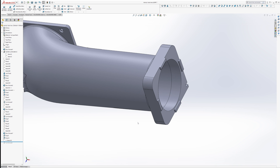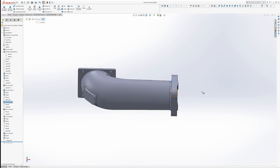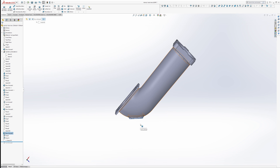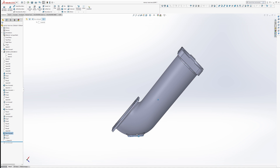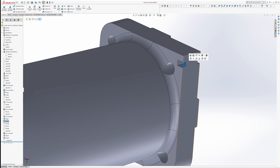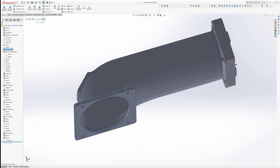There are a lot of dust collection flanges on Printables or Thingiverse, but I decided to design my own since I was already designing this part. It just has a couple of nubs that mate to the opposing part, and there are some pockets for magnets so it'll be magnetically held together. There's also a print-orientation feature — it'll be printed on that base so this whole thing isn't supports. And the little feature I'm most proud of is a zip-tie slot: there are some vents conveniently located on the back of the laser, so this will zip-tie against the vents since it's cantilevered out pretty far — I didn't want it putting a lot of stress on the flange.